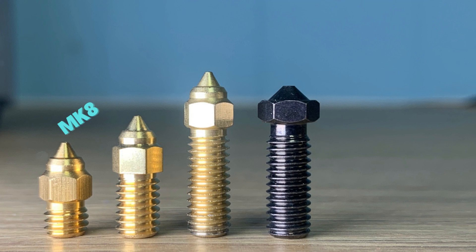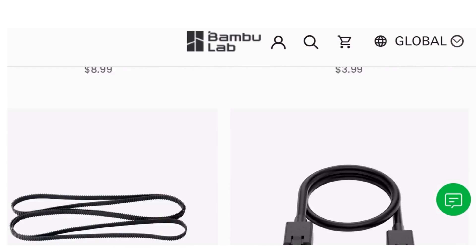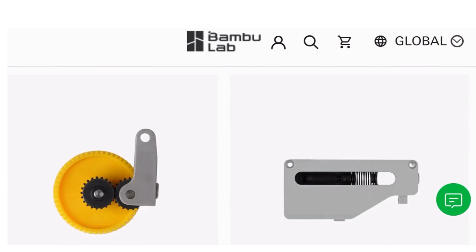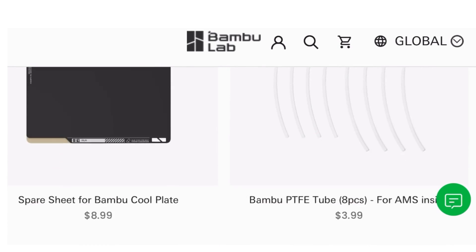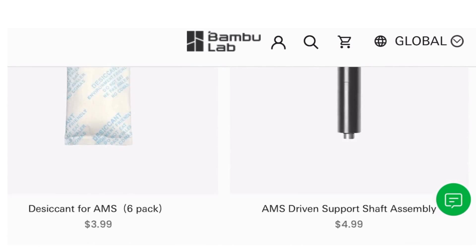The K1 is more friendly when it comes to modding the hot end and buying third-party nozzles. Creality makes their own nozzles, but a regular Volcano fits fine. If you want to try something from Bondtech like a CHT, go right ahead. Bambu's hardware is strictly in-house, but their web store is well-stocked and pretty cheap. You'll have to buy a whole hot end if you wear out the stock stainless steel nozzle, but it's about $10, so it's hard to complain.